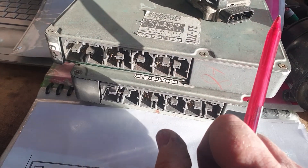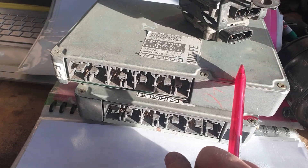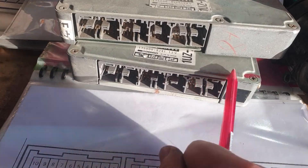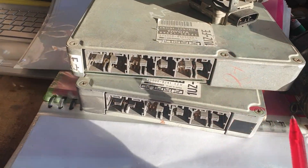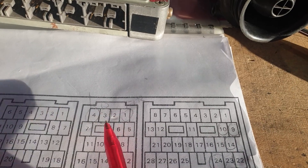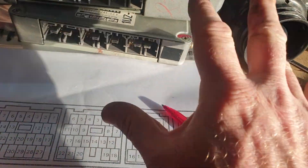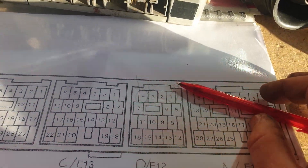At least it'll allow you to test it, and if it is the problem, we'll look at rebuilding the one that's in it if possible. This other one is a rebuilt unit, so that would be a good option as well — and that's got no hydraulic fan. Just double-checking: pin three is the check light, gives an earth; ground pin five to turn the check light output on. Working correctly it'll on-off, on-off with no codes — otherwise long flashes are tens and short flashes are ones.